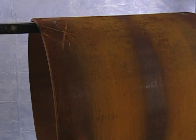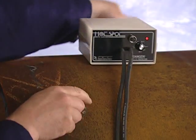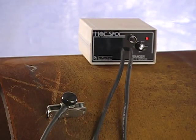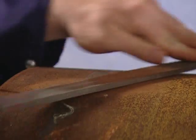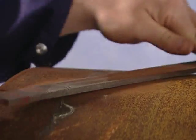Now let's look at how to properly attach thermocouples to a pipe or workpiece. To attach thermocouples, use a portable thermocouple attachment unit. This unit will spot weld thermocouple wire directly to the workpiece to ensure accurate temperature measurements. It's important to attach thermocouples to a clean surface — often, filing the surface or grinding must be performed.